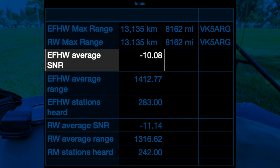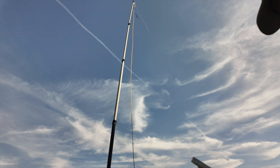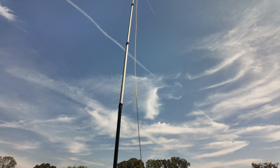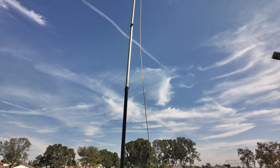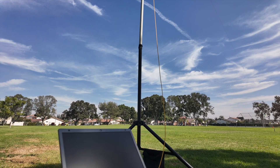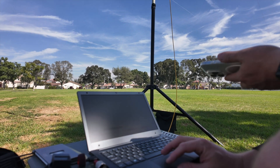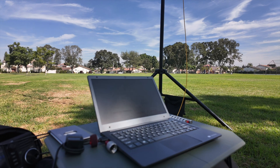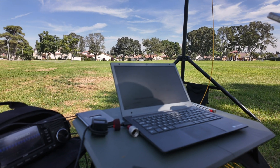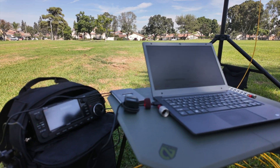When stacked up against each other, it tells us that we got an average 100 miles longer range with the NFED half-wave, about 40 more stations, and slightly better SNR. But all things being equal, they functioned very similarly. So the question you have to ask is: if you want many bands of operation — 80 meters, 40, 20, 17, 30, you name it — then the random wire might be the way to go, but you always need to make sure you have your antenna tuner with you. Most base station radios generally won't tune a random wire; you need something closer to a 10-to-1 matching antenna tuner versus the 3-to-1 you see in a lot of 100-watt base stations. But many QRP radios will be able to tune a random wire, like an Elecraft KX2 or KX3, Xiegu G90, Xiegu 6200 — those guys will generally handle the job.